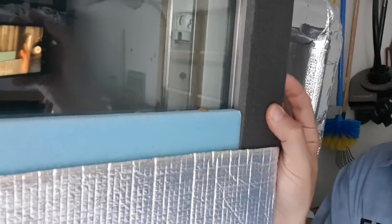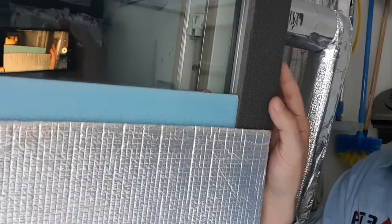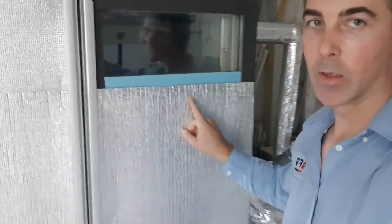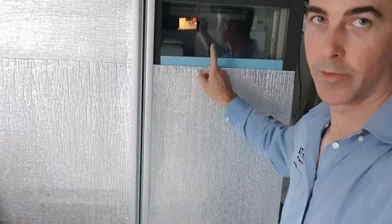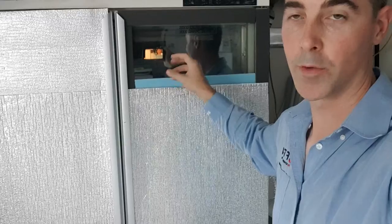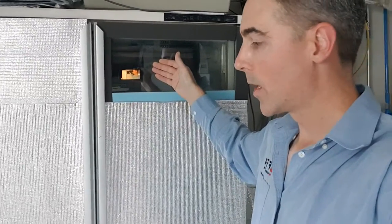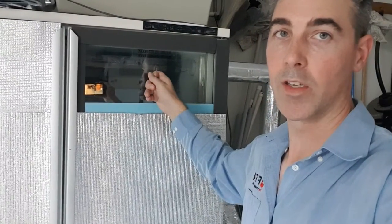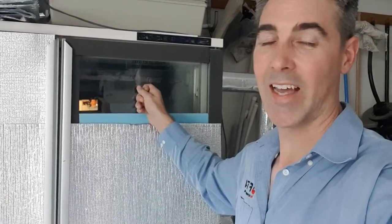I put a foam strip around the outside first to frame the glass and separate the aluminium from the insulation as a thermal break. Then I put the battens on, glued them with liquid nails, and liquid nailed all the insulation on - that was just done yesterday. One door is completely covered, and the other door has a small viewing panel so I can look in without opening the fridge and losing temperature and humidity. But I think this viewing panel has to go, because I can feel it's really warm - it's about 30 degrees today and the glass really does heat up.